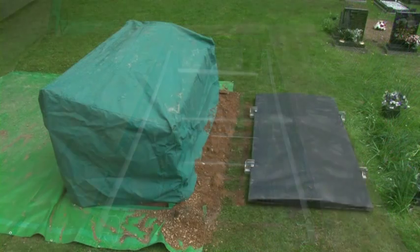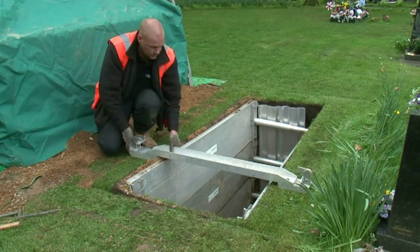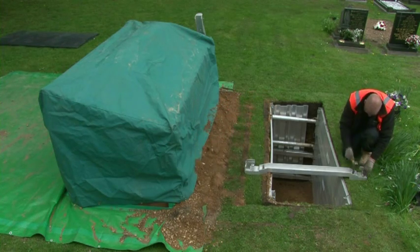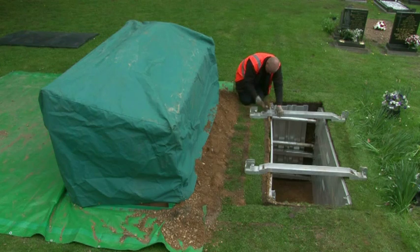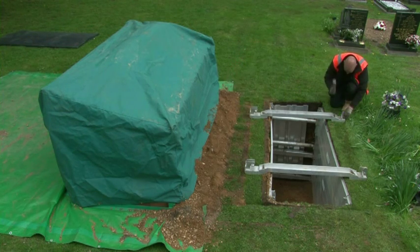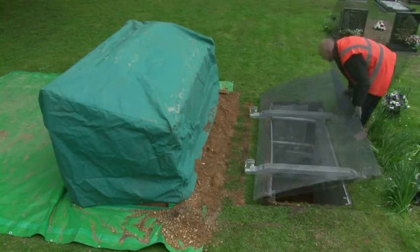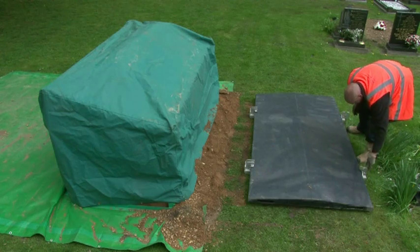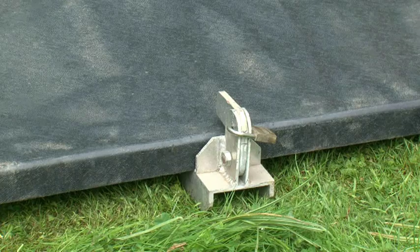If required, a lockable cover can be fitted. This consists of two fabricated aluminium cross members which are secured by driving steel pegs into the ground at an angle. If the ground is too hard to drive the pegs, the cross members can be secured directly to the handles on the top shoring unit by ratchet straps or chains. The polypropylene cover is now inserted under the two fixed lugs on one side of the cross members, lowered into position, and the hinged lugs on the opposite sides are swung over and padlocked.